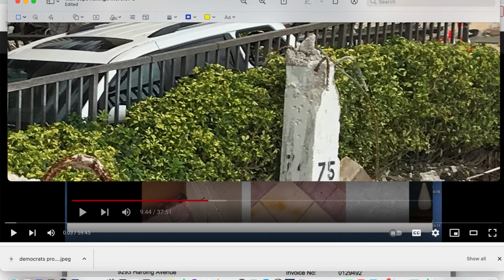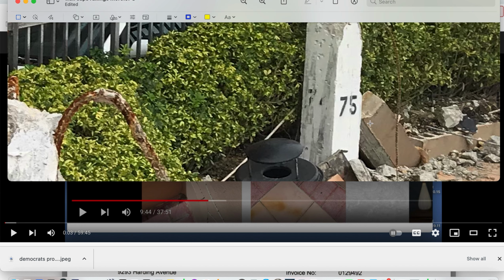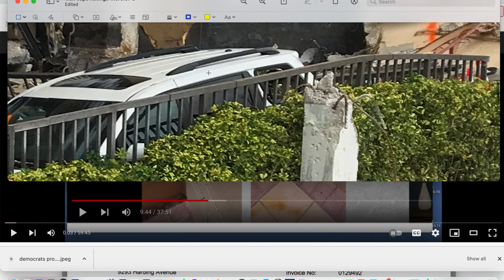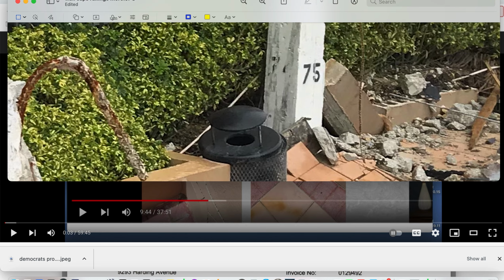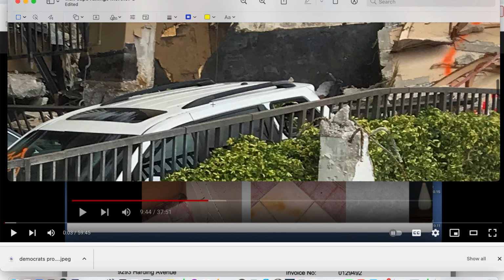And as it's pulling down, some torque action as it's going down is pulling back towards here. More dragging is going on. So on the opposing side, we probably wouldn't see much besides this running down there, fracture there. This reinforcement rebar tells us that this rebar right here was across the head, further down here. It lost engagement. It lost its bond strength. I know that side lost because this side is still engaged.